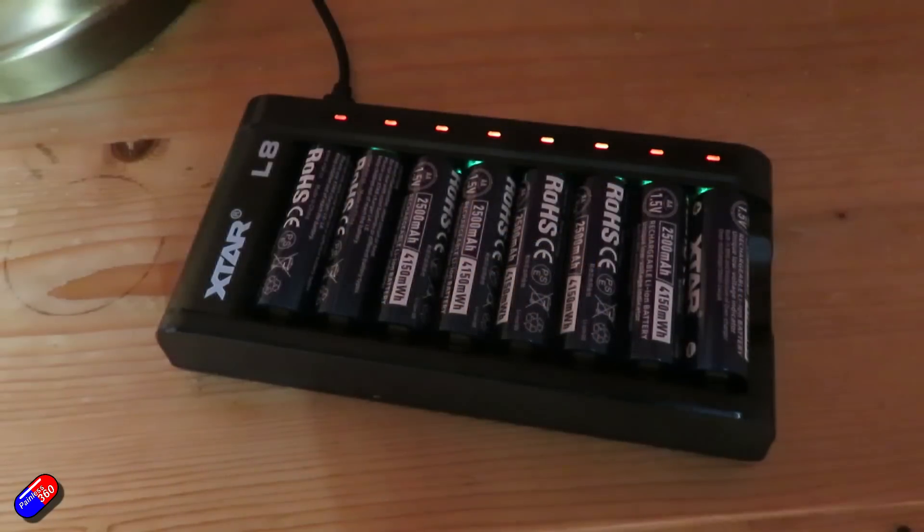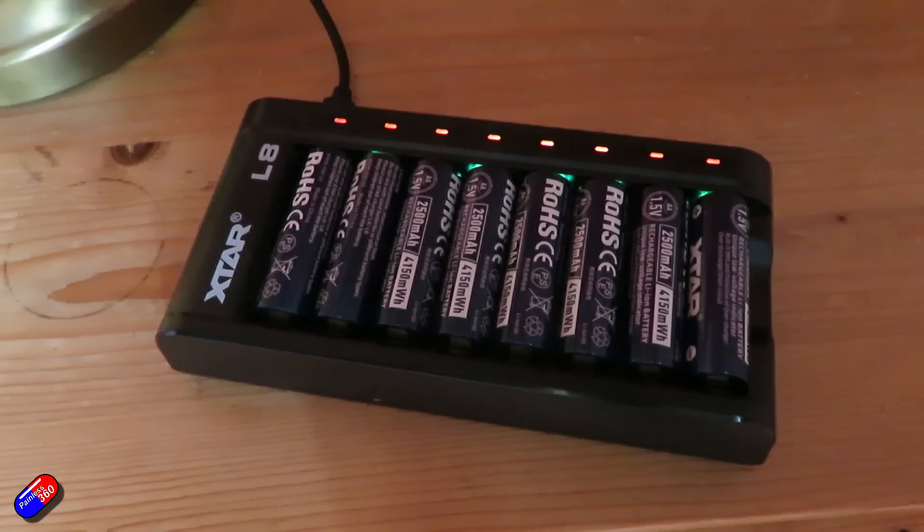Specs on this: it has a USB-C connection. To get the best from it you're going to need a QC 3.0 power supply capable of delivering 18 watts, though I've also tried it on regular power supplies and it seems to work okay. The size is 153 by 76.5 by 27.6 millimeters, about 118 grams in weight — not particularly heavy. It has protections for overcurrent, overvoltage, undervoltage, and output short circuits.